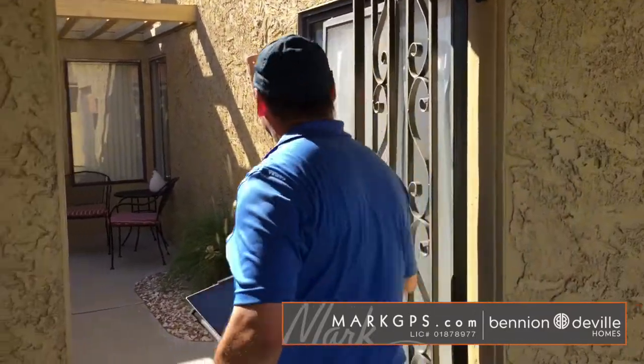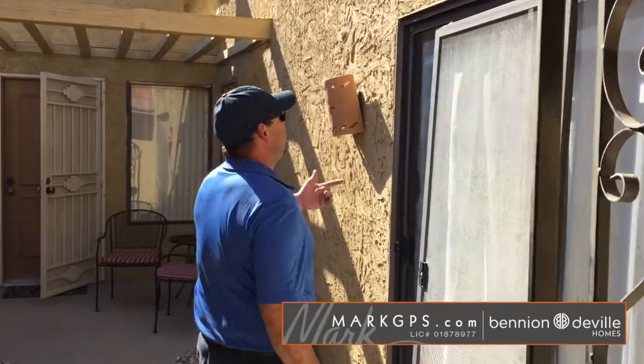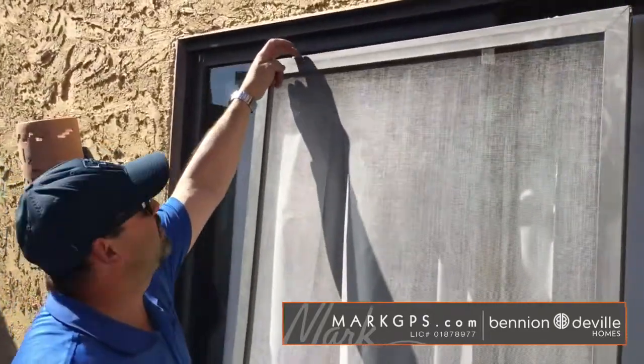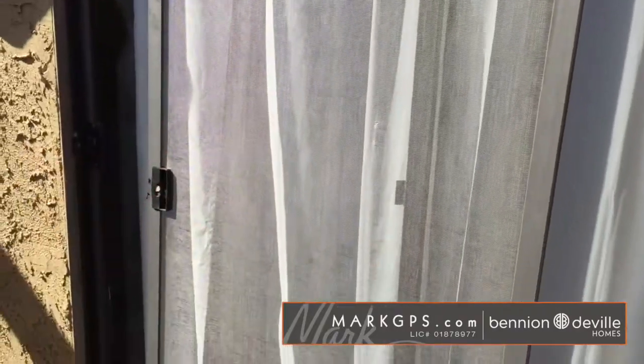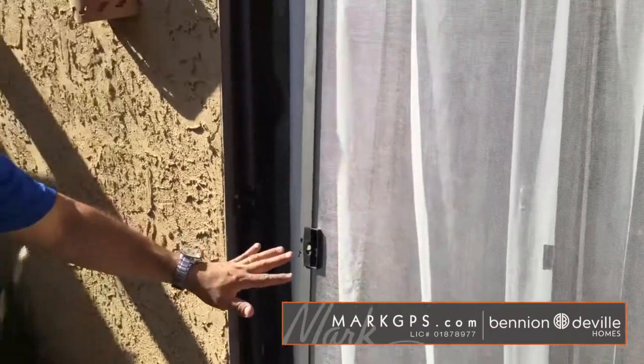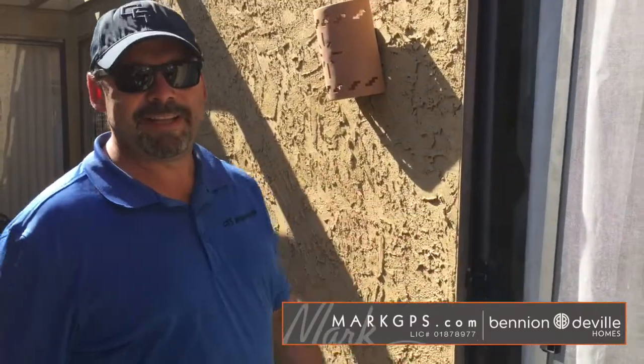Okay. Also, we have quite a bit of these. You'll see it in the report, but you got some damaged casters for your slider screen doors, on a lot of slider screen doors where the plastic casters are broken. Got a little bit of torn material on some slider doors, and a lot of them are off track. Okay, so within each room, you'll see that I noted that.